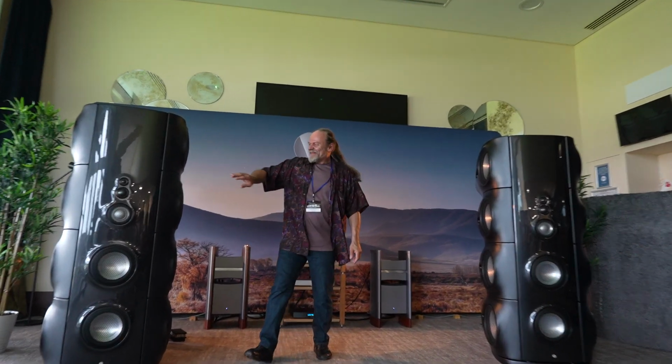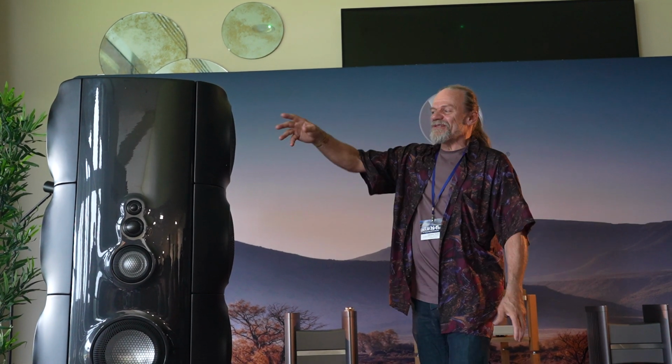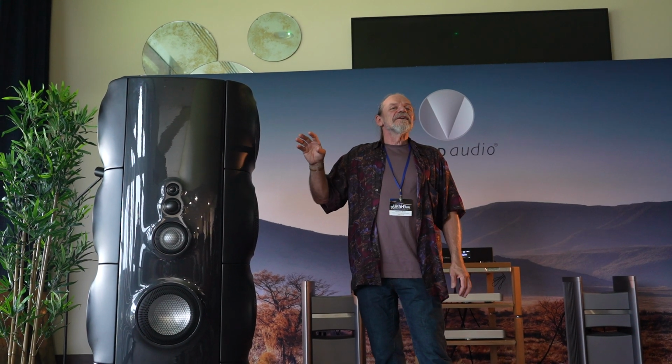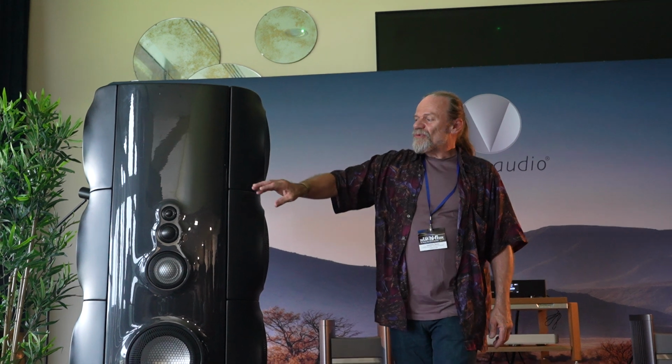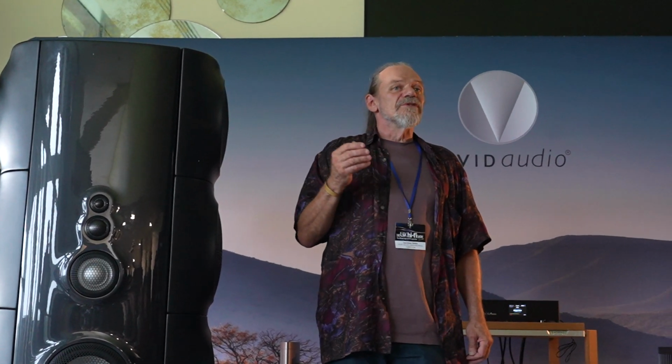So, lovely drivers, lovely acoustic environment, nice absorption, decoupled, all that. But they're all individuals. No, we're not. They have to be combined into a system. Each one has a range of frequencies over which it gives an optimum performance. And the job of dividing up the frequencies is given to the crossover.